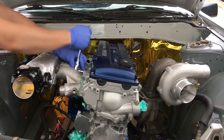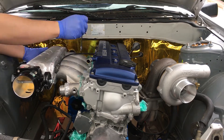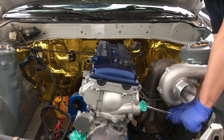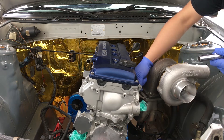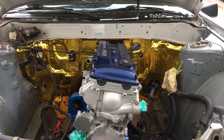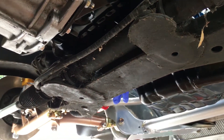So enough talking, let's get to it. To kick this whole thing off we got to remove both the intake and exhaust manifolds. I don't feel like working around them just to get to the motor mounts or to the steering rack, and the good thing is that the manifolds aren't in permanently yet so there's no gaskets to worry about. Now we have the manifolds off — let's take a look at what we're working with. Taking a look under the car we can see that this steering rack is in some serious need of some love and care.